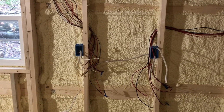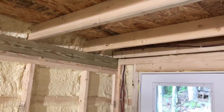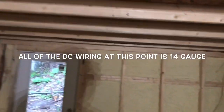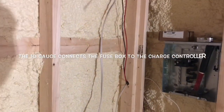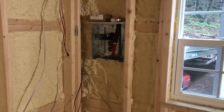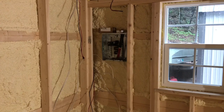It also has a digital readout telling me how much is on my batteries. I went up through a chase to get the wiring into my loft where I'm sleeping right now — you can kind of see it hanging off the ceiling back there. The big main lines I'm running here — I'll have to check the gauge — this is 10-gauge wire. I'm using that thick red 10-gauge wiring, laid loose right now underneath the main breaker box. I'll need to figure out how to route it outside this wall without creating gaps for rodents or ants.